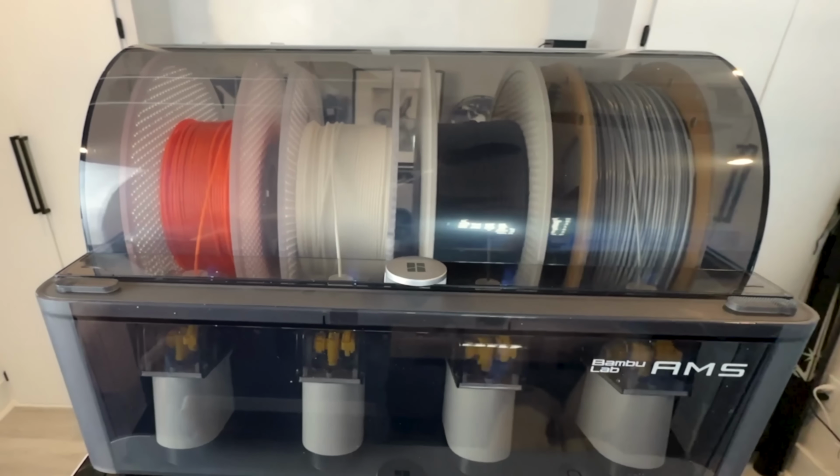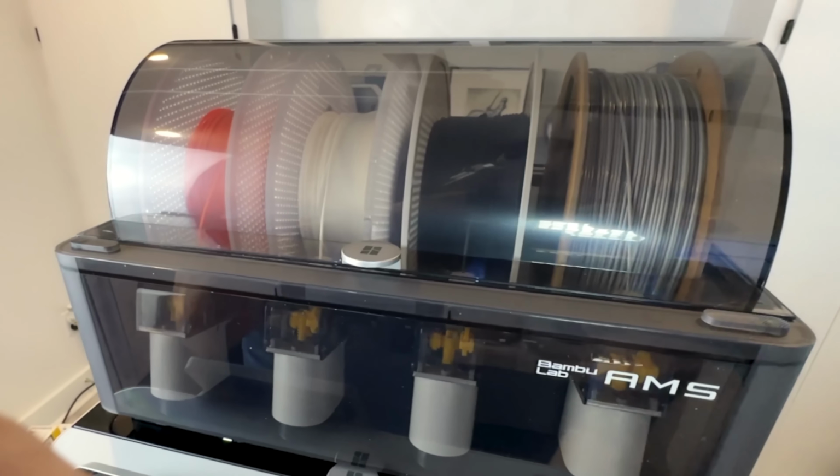And most of the social media buzz that you do hear about this printer, I gotta say, is living up to the hype. Now from a specs perspective, it's got a 0.4 millimeter print nozzle and extruder that comes with this printer, both installed, and you also get an extra one for backup. And overall it can melt polymers and filaments up to 300 degrees Celsius, which covers the spectrum of materials that you can use when it comes to 3D printing. Now the other thing that I like about this 3D printer is that it's fully enclosed, which also helps it print very quietly thanks to the tempered glass front doors.